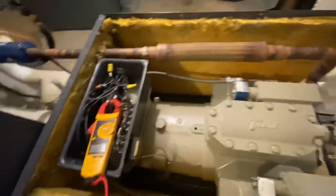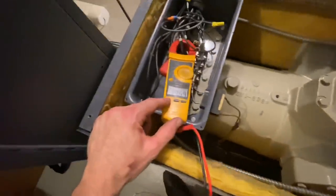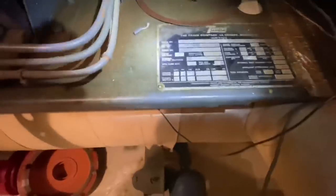Try the go — and boom, it's probably jammed up inside, can't get going. 196 is not bad though. Let's see what it's rated for — lock rotor 420. Should be a lot higher, so it's kind of jammed.